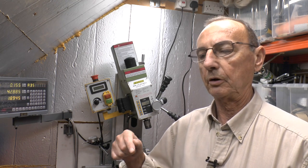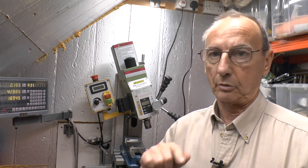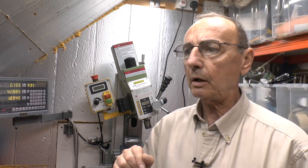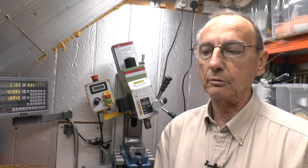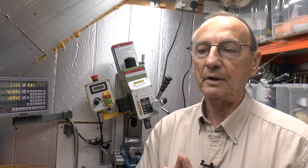Clearly on a 3D printer that's going to be a problem, because we only have steppers fixed to the screw. We can only set the position of the screw, not the actual carriage, and backlash will change that. That's one problem with using lead screws on X and Y. You can reduce backlash by using a split nut - splitting it in half and pushing the two halves apart so each flank is always in contact - but that increases friction. And you need a slight clearance to turn the screw, so there will always be a little backlash.